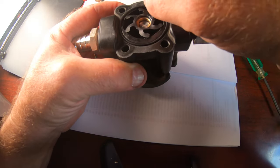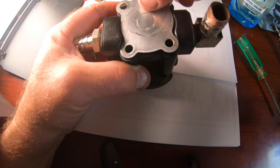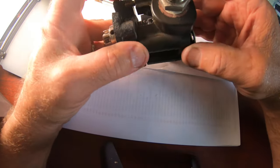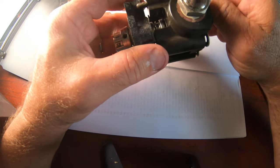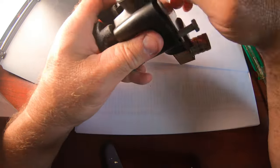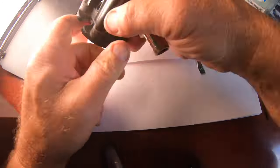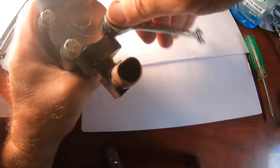This shows the correct orientation of everything. Then you just put the cover back on with the wear side down — unlike what I had here — and snug the bolts up evenly. I realized the error I had made before I installed the part, so I took the bolts out and flipped the cover back over before installing it.